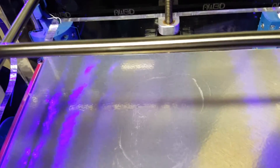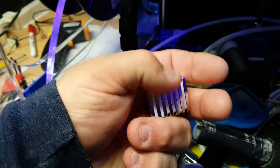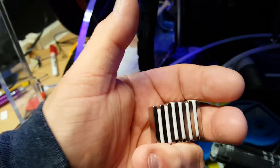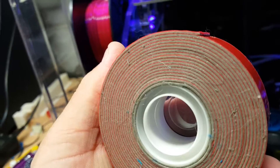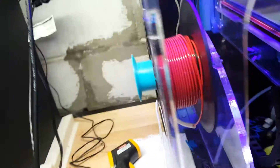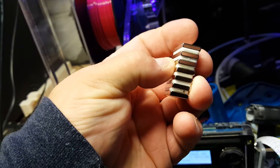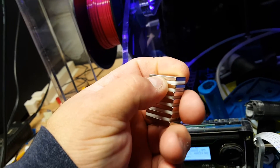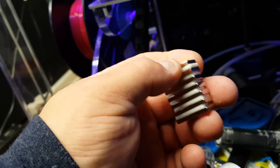Since there's no magnetic base available, what I did was order a bunch of high-powered, high-temp magnets from Magnet4Less — I'll put a link in the video. Then I used 3M double-sided outdoor tape; you can see it right there, it's gray with a red covering for the sticky. It's the same width as one of these magnets. These are one inch by quarter by eighth; they have two-inch by quarter by eighth ones. These are 12 to 13 pounds pulling force; the other ones are 23 to 26 pounds. They ship with little spacers between them.